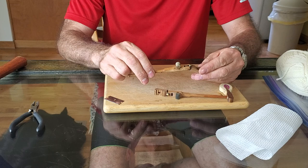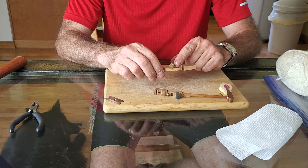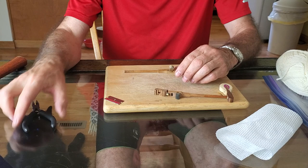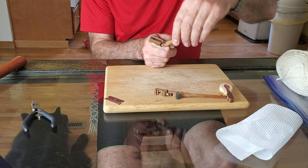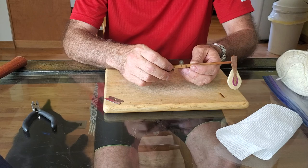This is what they look like when they're older but still have the proper shape — this one has actually had some repair done to it. What you're looking to do is have a nice, smooth, rounded edge on this side, the short side, so that the jack can hit it at the correct place and slide right off it, lifting up the hammer. When they wear, they wear right here — they'll typically be shiny and no longer have the correct shape.